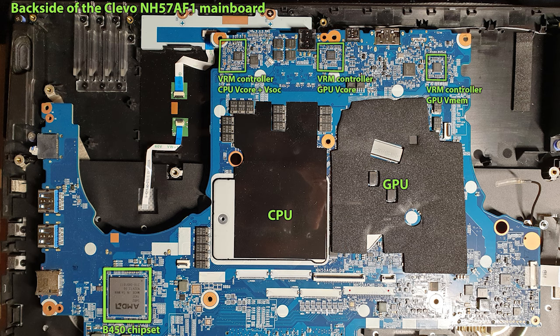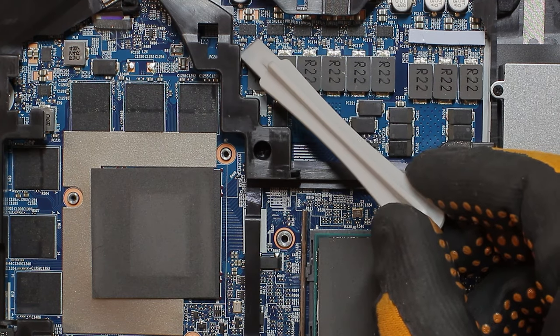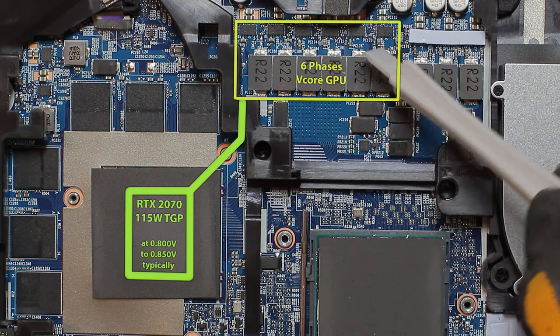The voltages needed for modern chips are usually very low, mostly in a range between 0.6 and 1.2V. And if you keep in mind that we usually have between 65W and 300W power draw from CPUs and GPUs, you can already guess that the required current at such low voltages will be quite huge. In fact, we look at roughly 110A which the core of the RTX 2070 mobile requires in a full-load scenario. But 110A can't flow through such a tiny chip without making it glow red-hot, so VRMs use multiple external half-bridges, including MOSFETs, often called phases, to split up current between them.